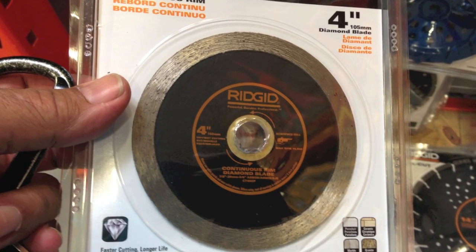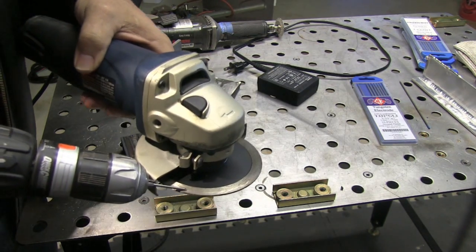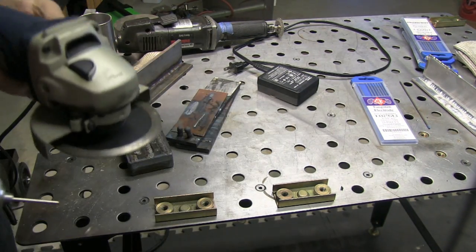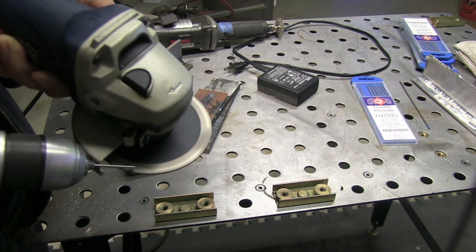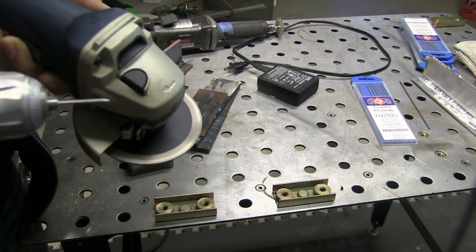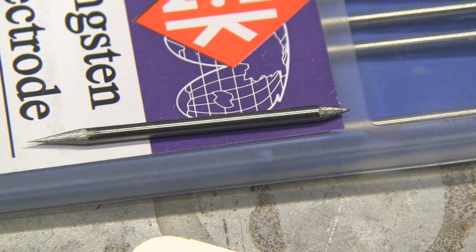Another way I've read about on forums — and tried here, though I don't really recommend it — is a diamond cutting wheel on a 4½-inch grinder. I've seen guys drill holes in the guard and poke the electrode through to support it. I just prop it against the guard. The sparks, while not trapped, at least get directed and don't go everywhere. It actually didn't work too bad — put a really quick point on one, just with rough scratches. The point on the right is from that diamond cutting wheel; the one on the left was done on a belt sander with about 100-grit belt and has much smoother scratches.